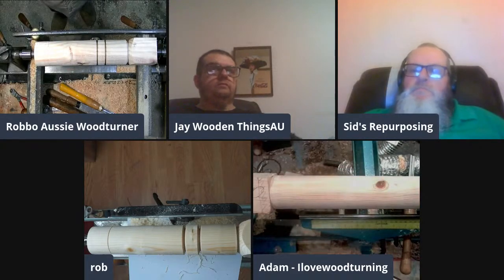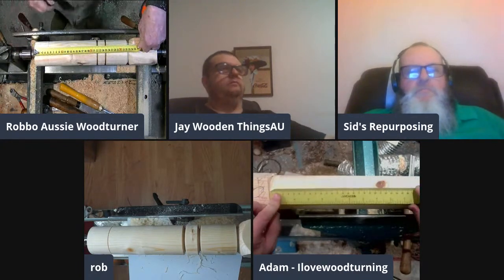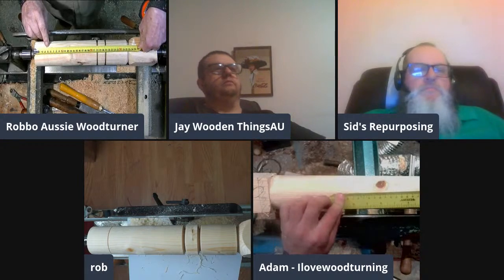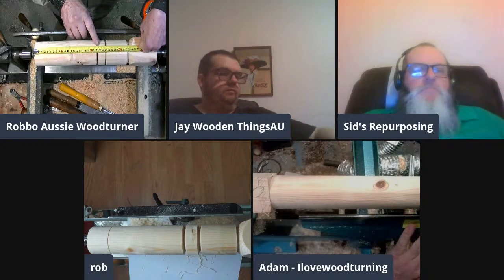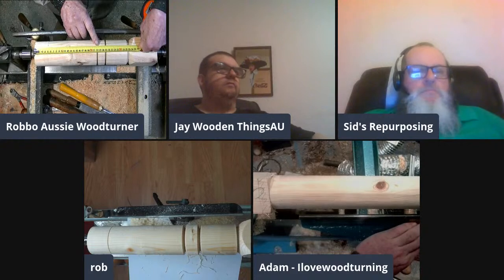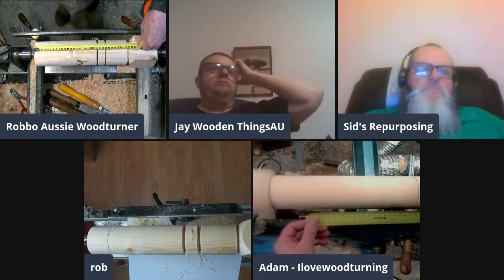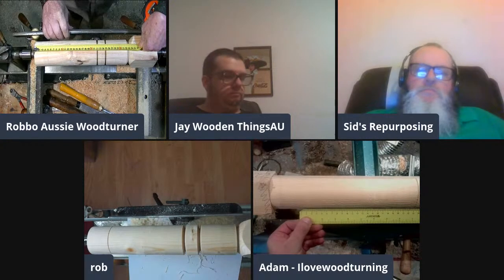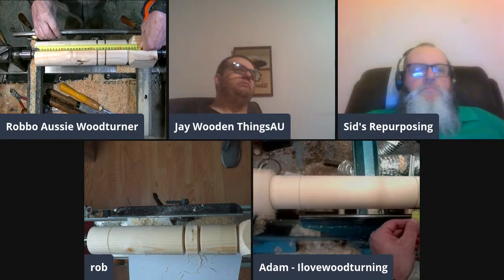Get a tape measure. From the bottom of the leg, 50 mil. Mark a line there. 50. Then come up to 220. Now extend the tape measure all the way out. Oh, you want me to use a tape measure? Okay. 220, did you say? Yeah, 220. Then at 250.